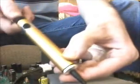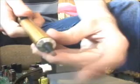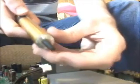If you put pin headers in, then it means you have to desolder every single point, which, unless you've got a really good desoldering gun, it's really difficult. You find that 80-90% of the points all come out with a bit of desoldering braid, and maybe a desolder pump. I've got this desolder pump, one of these. You just push down, you put this end against the solder, you put your soldering iron on the underside of the board, and then you push the button, and it's allegedly meant to suck the solder out. But to be perfectly honest, this is weak. It's useless. So I've been using desoldering braid.